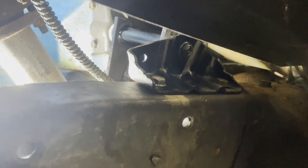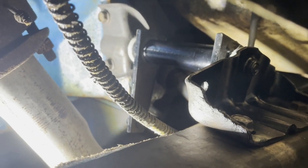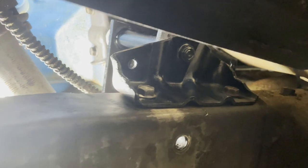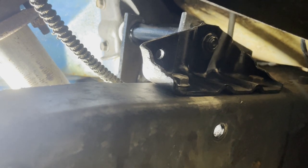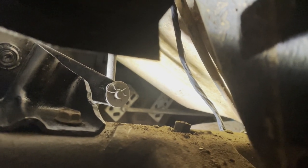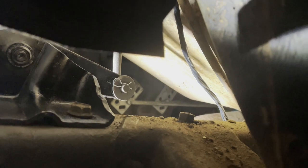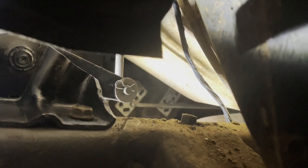There it is — you can see there's a new black piece on top, just those two bolts. That thing's reinstalled; you can see all the little washers and everything. Now I just have to hook up the rod that comes down from the pedal and then the rod that goes back to the clutch lever on the transmission. I went ahead and put that little plastic bushing in, then that washer, and got the cotter pin in there — just a chunk of wire that they had in before. It's a lot tighter than it was before; when I first did this that thing wobbled around like crazy. Now I just have to go down and do the other side and we'll be all back together on the clutch.